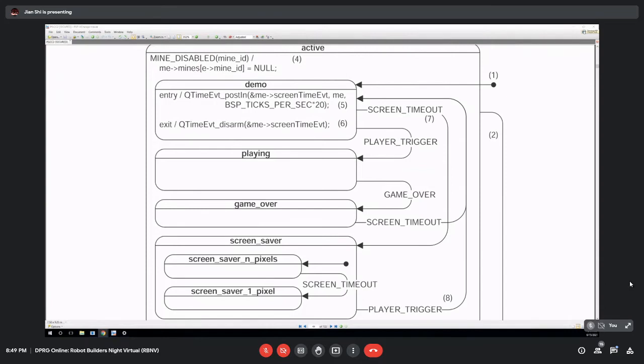And you can abort those states. If you don't get to where you want, you can return to previous states and so forth. The nice thing about a state machine is that it's real easy to abort. You just reset the state to the first state. You don't have to mess with any variables or anything. Yeah, we used to do it like current state, current input, and then current output and next state. That pretty much describes everything you need to get in and out of a state.